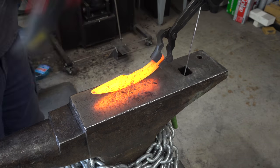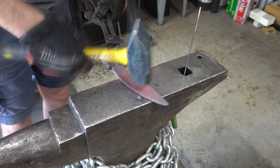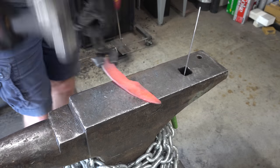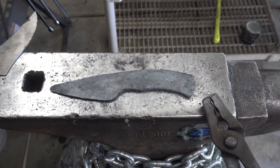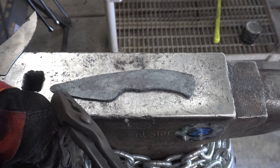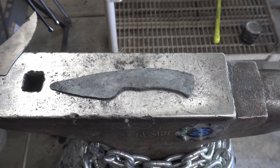Now I'm just doing a little more work on that finger well just to stretch it out a little bit, and then I'll put the final bevel in the knife. I'm done forging on this blade — you can see that I changed it kind of halfway to be more of a skinner, so I went with a shorter, wider blade. I'll kind of swoop this a little bit, same kind of finger choil here, but I like it. Let's finish it off.